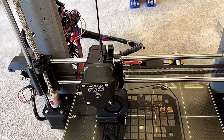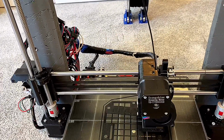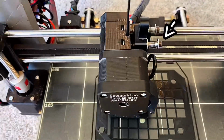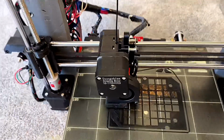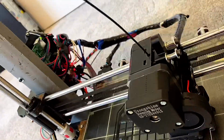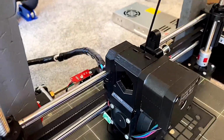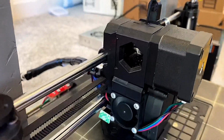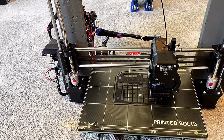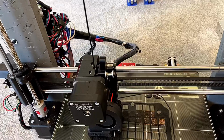in the tensioner system, if you compress the springs enough so that you can get those screws threaded into the square nuts that are in the extruder body, it holds the bearing tensioner against the filament, against the extruder gear, too tightly, and you get a bunch of clicking, and it under-extrudes when it clicks. Not a good solution. Those screws I have there are not perfect, right?